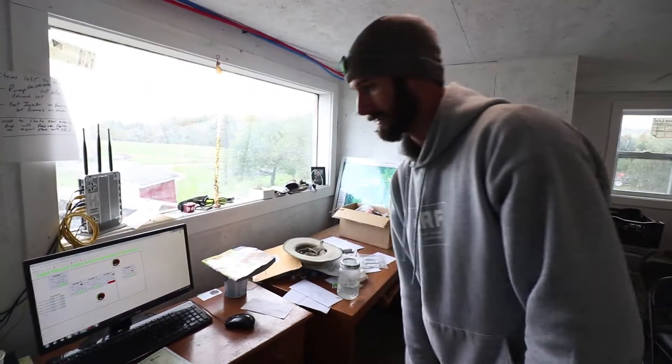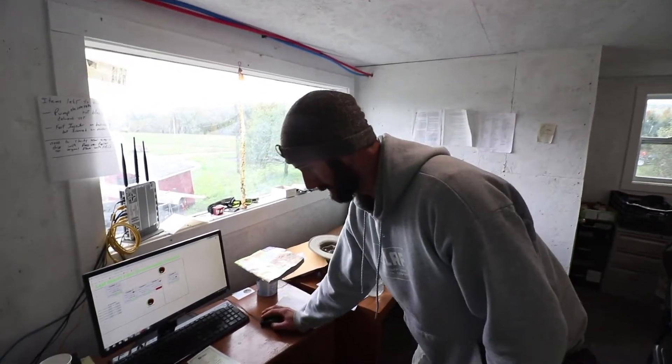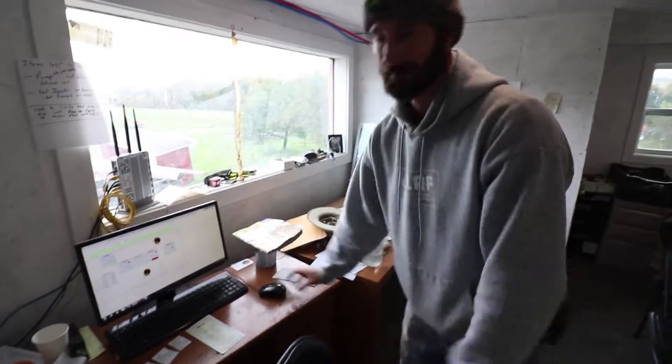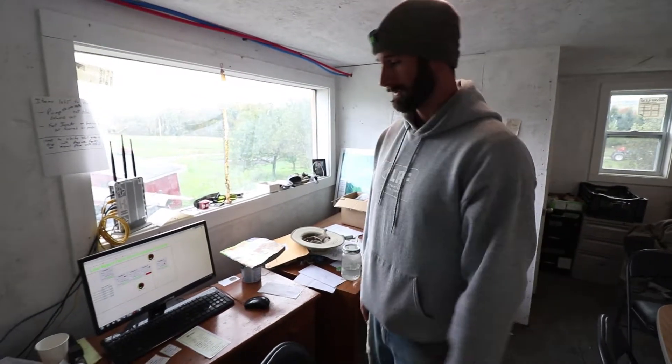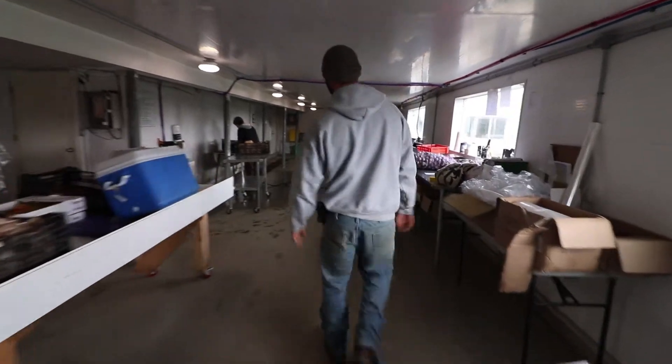For each one of these rooms there are relays that control specific outlets. They're based on whether they're turned on or off, or based on set points — so whether you want to heat or cool, you can change the temperatures. If you want it to get more or less humid you can change those too. Turning those relays on or off will turn on or off your heating or humidifier.